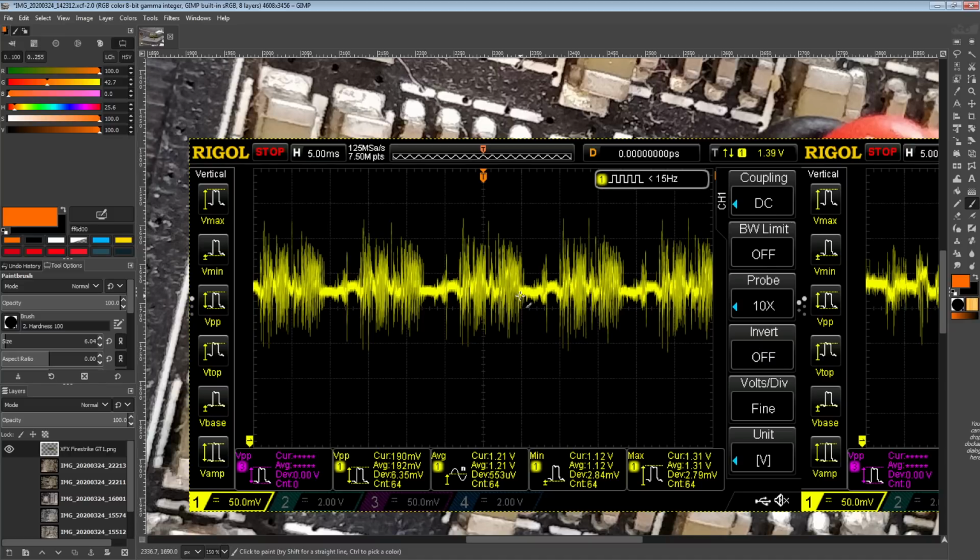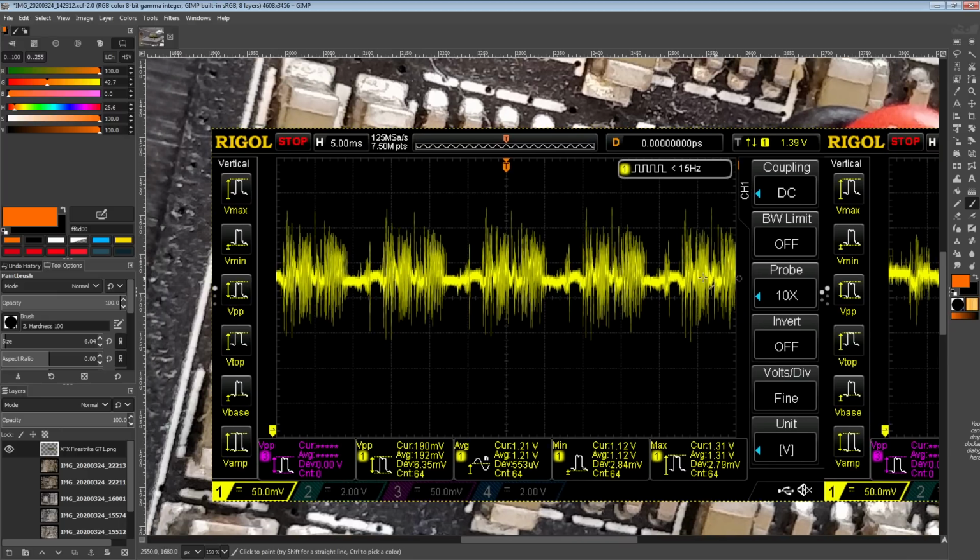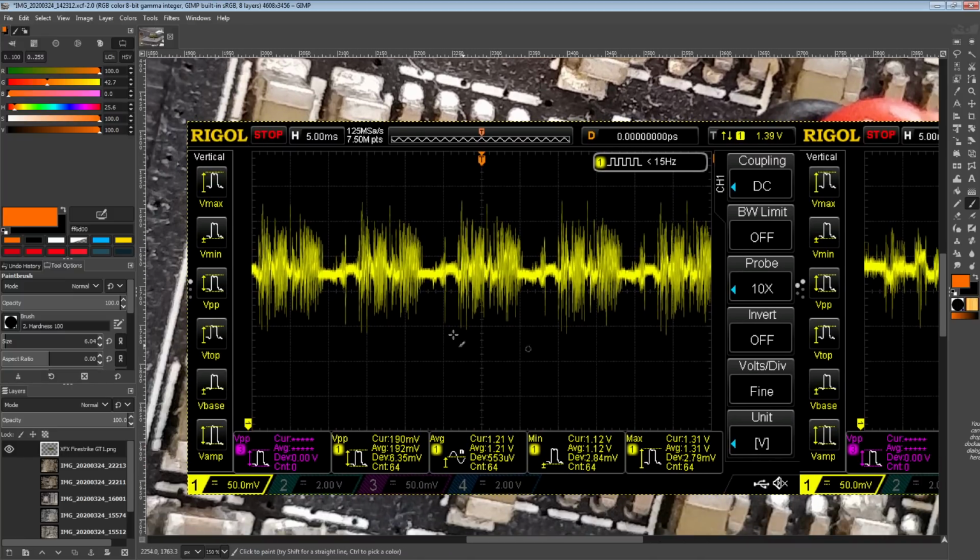You won't notice CPU instability in the same way, because CPUs run so much faster, and the workloads on CPUs aren't periodic, where suddenly we're doing this, and then we're doing that, and then we finish the frame and send it off, and then we do another frame, going through the same set of steps again. You don't really get something that looks a lot like this, unless you have a workload that is very steppy. If you have a workload like Cinebench, it's just a flat line with the occasional spike from the Windows event timer. So that's an interesting difference between CPUs and GPUs.